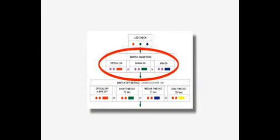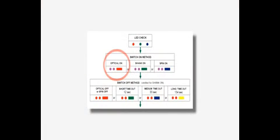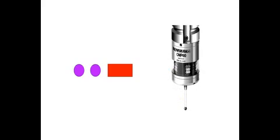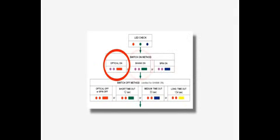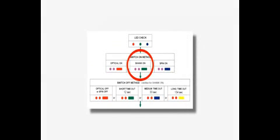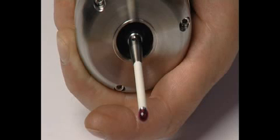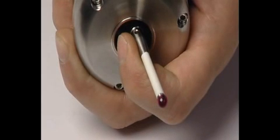The OMP60 has multiple switch-on methods. To change the switch-on method, deflect the stylus for 1 second. The switch-on methods are violet, violet, red, optical on, using an M-code start signal from the machine interface; violet, violet, green, shank on, when using a shank with an integrated switch supplied by Renishaw; and violet, violet, blue, spin on at the speed quoted in the user guide for between 1 and 6 seconds. To move to the next option, the stylus should be deflected for at least 4 seconds.